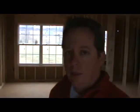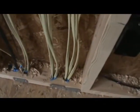Electric panel — everything's looking good. I mentioned in some previous updates that I do a pre-punch list for the framers before they're done, so they know exactly what I'm looking for as they're wrapping up. Here's some things after the rough-in that you can come back and check. You'll notice the blue caulk at the holes — that is fire caulk. Anywhere there are holes cut through the plates, you have to put fire caulk in there to slow the progress of fire up into the attic in case of a fire.